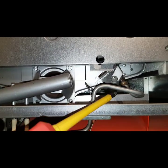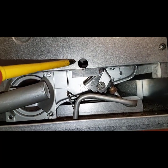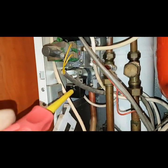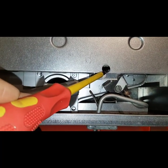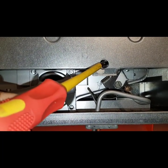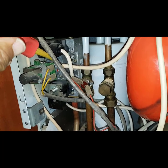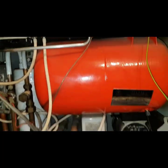So on the ignition side of things, if the pilot solenoid fails, no gas will come up to the pilot — the spark electrode will just be ticking continuously, waiting to light the pilot but getting no gas. If you hear that continuous ticking, that means the pilot solenoid has not activated. Another fault you can get is where the gas comes through and the pilot is established and lit, but you're not getting any main burner — it just sits there with the pilot light going. That means the main gas valve solenoid has failed and is not letting gas through.